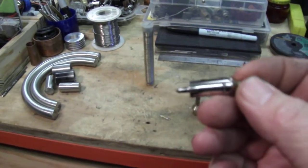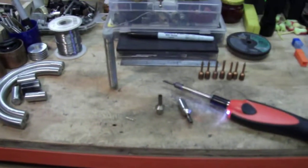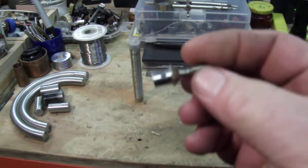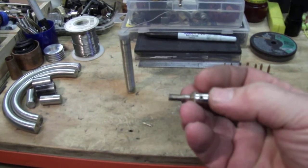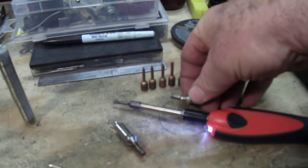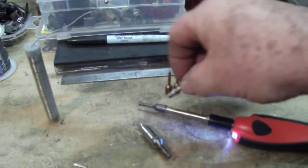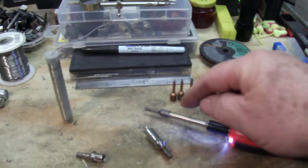So what I did was take some stainless steel rod and turn it on the lathe, made this exact shape. In essence I copied the exact dimensions but made it longer — as you can see right there. I drilled the center of it all the way up almost to the end of the stainless steel piece.